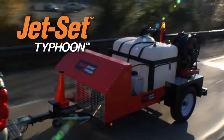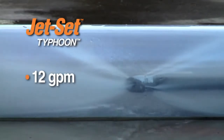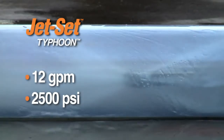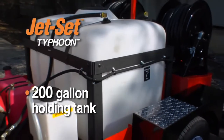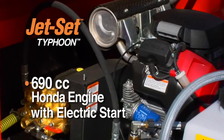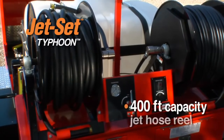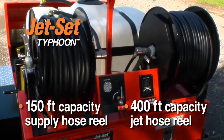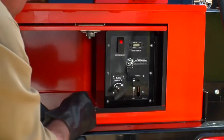The Typhoon trailer jet is the tool to use for cleaning large lines or remote jobs far from a water source. Every minute, 12 gallons of water pulsate down the line at a powerful 2,500 PSI to blast lines clear of grease, sediment and debris. The 200-gallon holding tank carries enough water to handle remote applications where water access is limited. A 690 cc Honda engine with electric start powers the 2,500 PSI 12 gallon per minute pump with VibraPulse. Two hose reels — a 400-foot capacity jet hose reel with variable speed electric rewind controller and a 150-foot capacity supply hose reel — are mounted at the rear of the unit. Engine controls including an hour meter are within easy reach in the lockable toolbox.